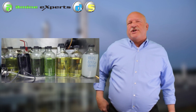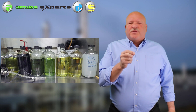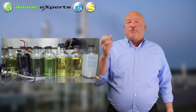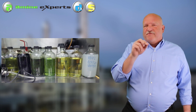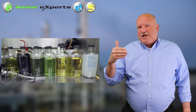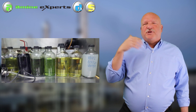Now most of the solids that are generated when we have corrosion in our system, especially iron sulfides, tend to be extremely small - something like 0.5 to 5 micron. Now our visual acuity is only 40 micron. That means anything smaller than 40 micron we can't see with our naked eye. So these solids, while they're present in the solution, we can't see them.